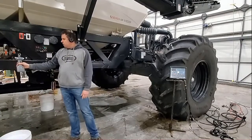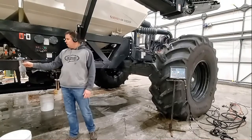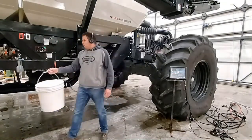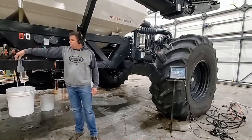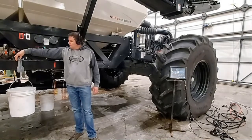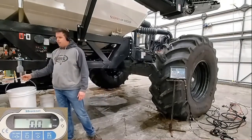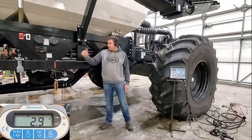Also find your digital scale. With the scale that's sent with the 9000 cart, it'll hold a tare weight for you. Turn the scale on, find one of your pails or whatever you're using to calibrate with, and hang it on there. To get a tare weight into it, just push and hold the on/zero button for about 5 to 10 seconds. Once you hold it for that 5 to 10 seconds and let go, it should show zeros. When you take the pail off, it should show you the weight of the pail and what it has stored as a tare weight.